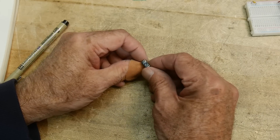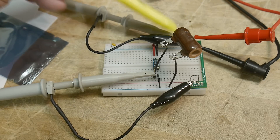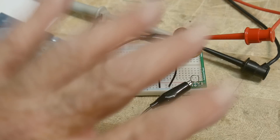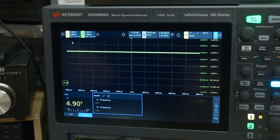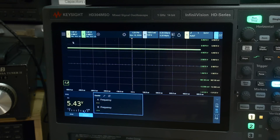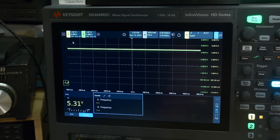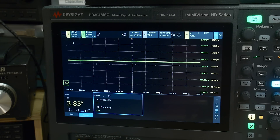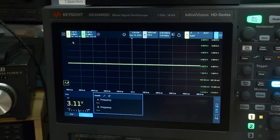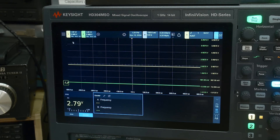Let's hook one up and make it go. We have it hooked up with a 10-ohm load, so I'm drawing half an amp. We'll monitor input and output with the oscilloscope — both traces are on top of each other. I raise the voltage up: 4.9, 5.4, 5.5 — bang! The output just fell. So 5.5 volts was the trip voltage on the high side. If I bring it down: 3.4, 3.2, 3.1, 2.9 — right around 2.8 — bang! It falls off as well. High trip point was about 5.5 V, low point was about 2.8 V.